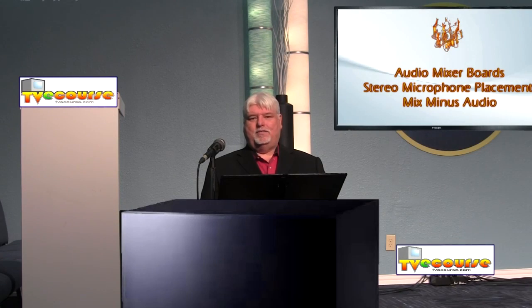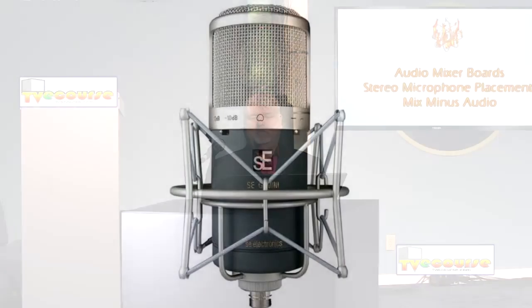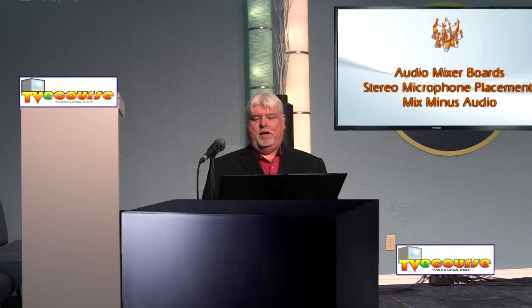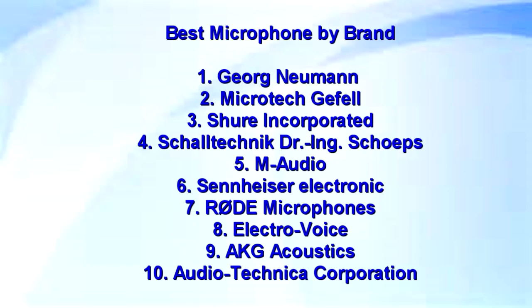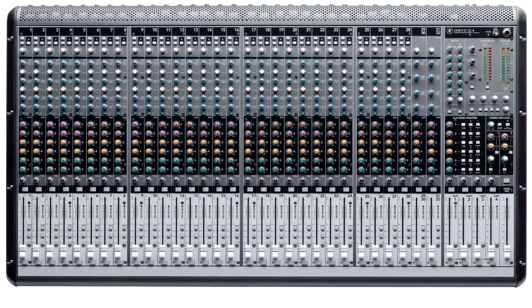You have different types of mics: a dynamic mic doesn't require any batteries, while condenser mics require batteries to work — usually an internal battery. In studio production situations, you have something called phantom power, which is roughly a 48-volt source that drives your microphone, giving it power to work. In most studio situations, that power comes from your audio mixer board.